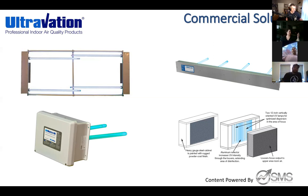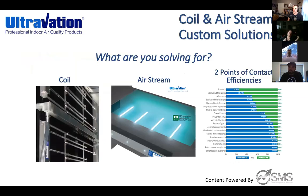Some architects have been challenged on their designs — choosing wrong RTUs and omitting UV on urgent care facilities. The builder ultimately sided with including UV to avoid liability issues down the road. IAQ is making a comeback even before COVID, and COVID is accelerating adoption. The construction professional needs to at minimum document that UV has been discussed — and if a customer declines it, document that too for protection, especially when it's in code.